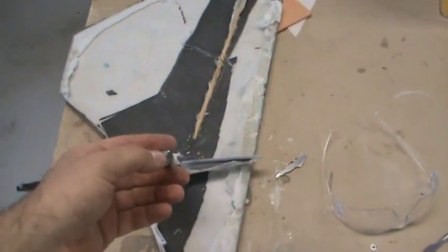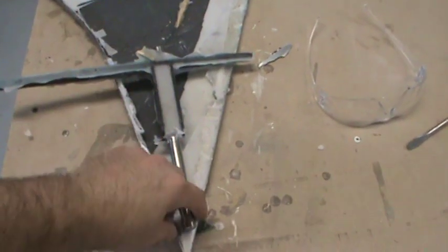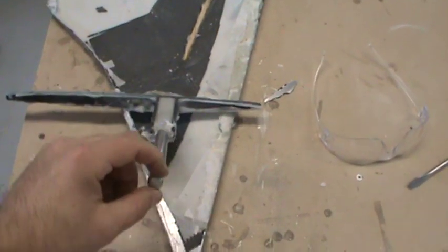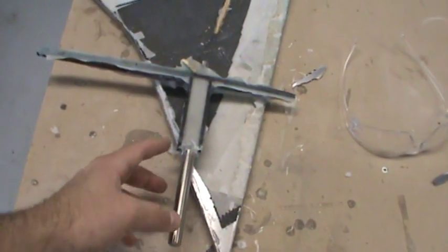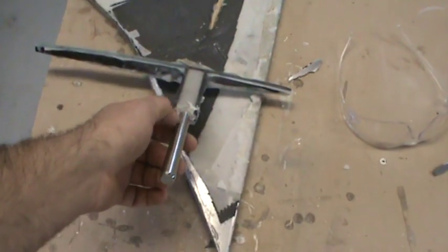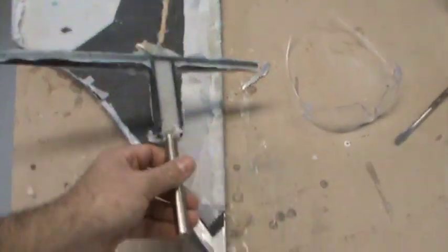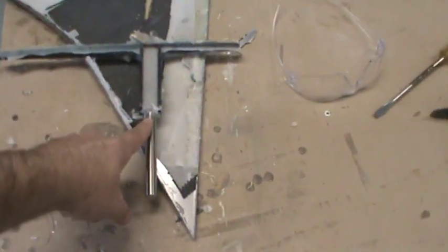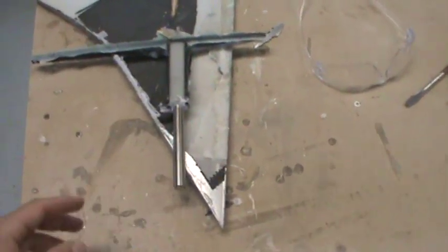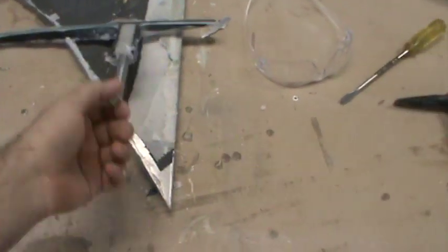The reason I say that is I've had a couple of instances with kits in the past where they used a steel tube — really thick wall, like a tenth of an inch thick, but a little bit smaller diameter. I've actually had the tubes kink just outside of the stab. Granted, the tube was probably a little undersized at about three-eighths of an inch. I've seen a spectator kick a plane during a noontime lineup and kink the tube without anyone realizing it, and then the tube failed in flight. Tubes are alright — I don't have anything against them — I just personally like a solid shaft.